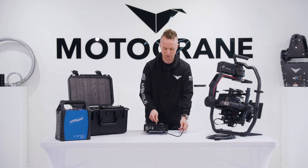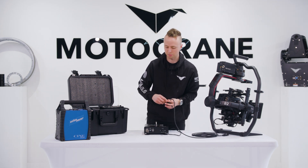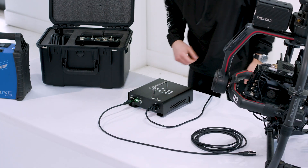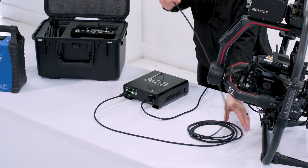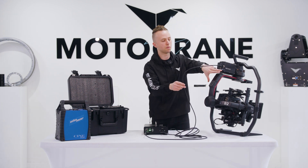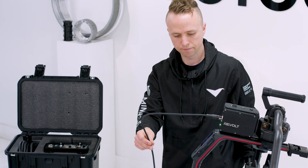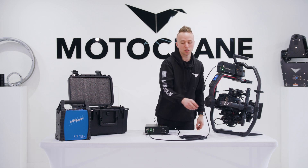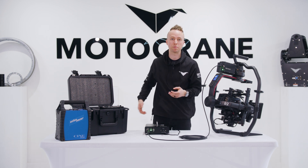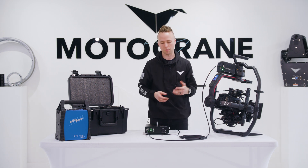With the AC3 ready, I have my 3-pin XLR output — I treat it just like the block battery. I plug it in, turn it on, and a green LED tells me I'm ready to roll, then provide power to the Revolt. This is excellent for studio applications where you're running for hours on end on house power, shore power, or wall power — no batteries needed at all.